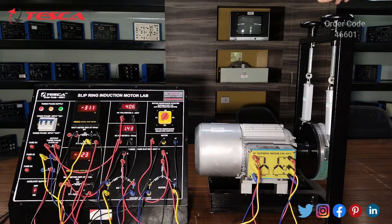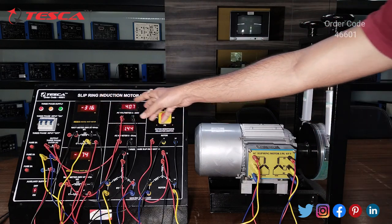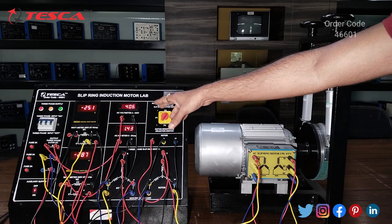While performing this experiment, initially you have to keep both pulley belts at the no-load position — we do not provide any load here as this is the no-load experiment. We have to loosen all the pulleys so there is no load on the motor. When you want to apply load, tighten them by rotating clockwise. In this experiment we keep it in no-load position with the belt free. Now you will notice the readings — this is the watt reading; the negative sign shows polarity, so you can change connection positions to get positive values on the wattmeter.